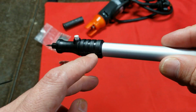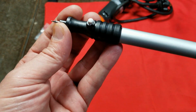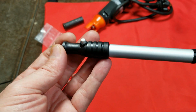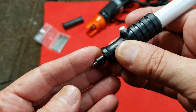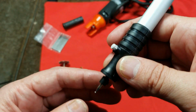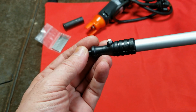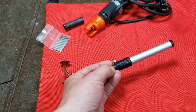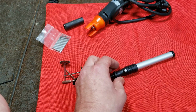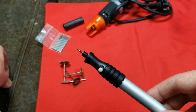And you could custom wire this to a little power brick that was a 3-volt power brick. The motor only uses just a couple amps of power. And then you could actually get rid of the whole stem and the weight of the batteries. And then this little thing is just a little motor with a couple lightweight wires coming off of it. Could really be very handy in some detailed work just because it would be so compact and lightweight. It would really be pretty nice. Although having the mass of the batteries does help dampen a little bit of the vibration.